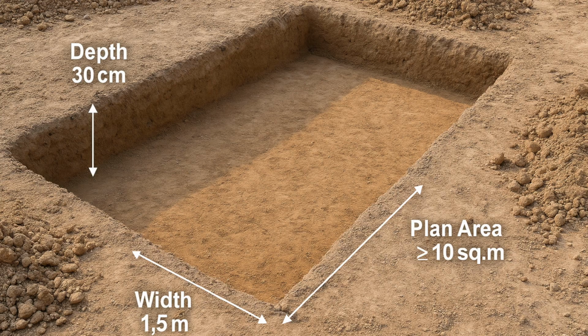So lifting is normally for all earthwork, it is 1.5 meter. Here also it is 1.5 meter. Normally we are going to take a depth of 30 centimeter, so the lift won't go higher than this. In case in some condition it is going higher, you will get paid extra, but mostly that condition won't occur. So it depends upon your site conditions. For this condition only you are going to work.